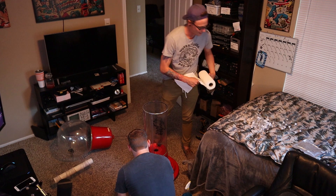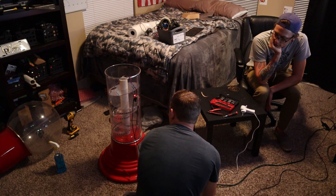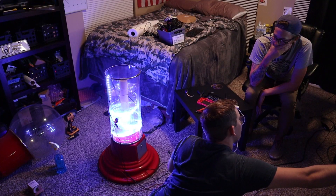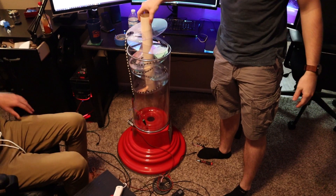Today is the day after the build and I messed up a little bit. Gaston came over and showed me the gumball machine for the first time. We cleaned it up, took it apart, and got ready to put the LEDs inside. Just to make sure we got it done right, we did everything twice — definitely not because we messed up. We soldered on the longer LED strip and tested the code with everything — it worked out perfect. But then, thanks to a cheap power supply, somehow a few of the LEDs got fried. Somewhere along about a 10-foot strip of LEDs, there's a controller or data pin that's messed up.